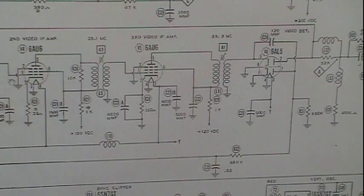Now in radio they're called AVC. AVC is nothing but AGC — it actually is controlling gain. The name AVC, or automatic volume control, was coined by marketing at one radio manufacturer or a couple of them. The exact whoever originally came up with it first is up for debate. But needless to say, it was marketing that came up with it, because they felt that the end user — the consumer, the people buying radios — would understand automatic volume control much easier than automatic gain control.